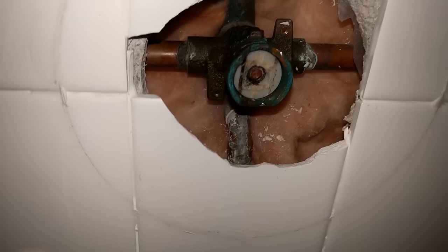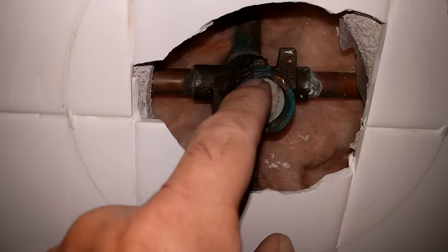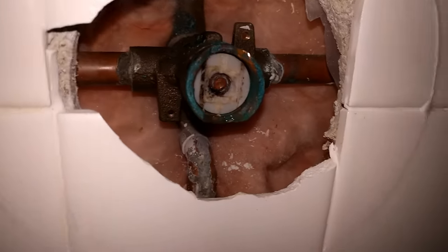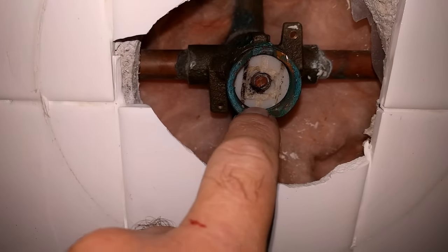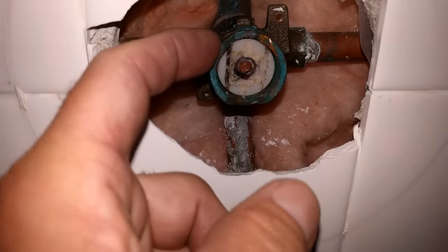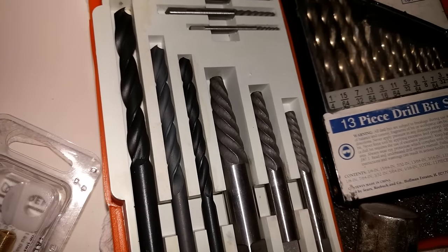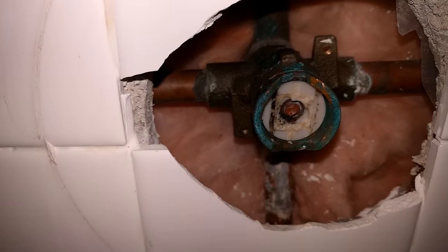It was going pretty good — it came out a little bit and then all this plastic stuff broke. It broke off in little chunks at a time, so I kept trying to pull on it with the needle nose vice grips and it didn't work. What I'm going to have to do is drill. I'm going to drill some holes around the outer edge to weaken it so it doesn't have as much grip, then I'll drill the center and use an easy-out, or if I have to, I'll tap it and put a screw in there to get it out.